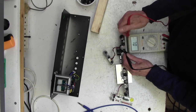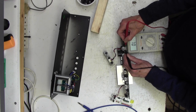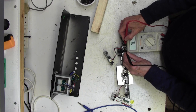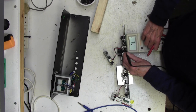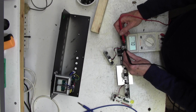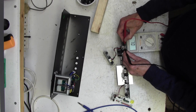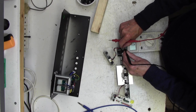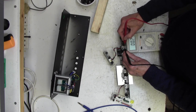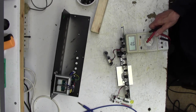We've got short circuit there because we've turned it completely to the left. Open circuit across the track - that should be 25k. So there's the problem immediately: this pot is faulty. Now as we turn it, the resistance should be coming up - still open circuit. And as we get to the very end - bang, see that? Short circuit. So that's what's happening: as soon as that gets to the end of its travel that pot's faulty. Don't know why, but there it is.